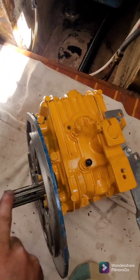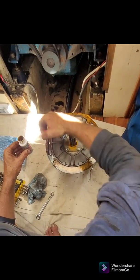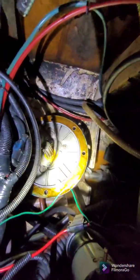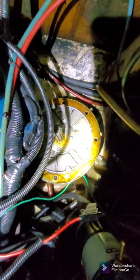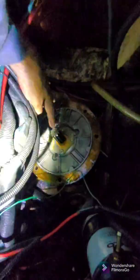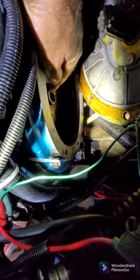We're just getting a bit of grease on the splines here, ready for fitting, and finishing applying a bit of non-hardening aviation gasket to the adapter plate where it meets the bell housing so that we get a good seal. The new gearbox and plate have been popped down onto the engine bay floor, and now I'm going to sit them into position and try to get those splines to match up into the flex plate coupling. Oh well, look at that - in she goes!